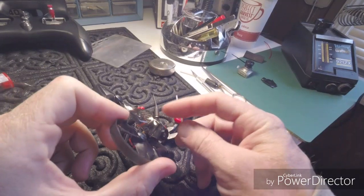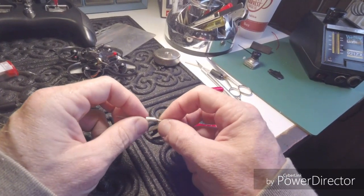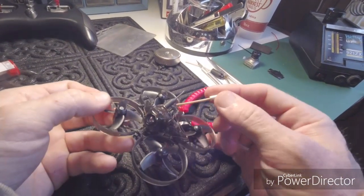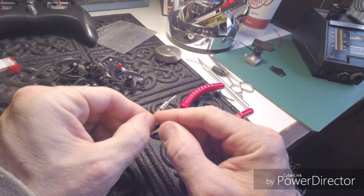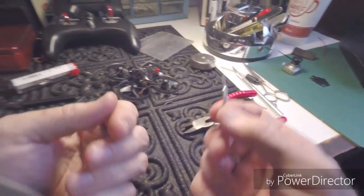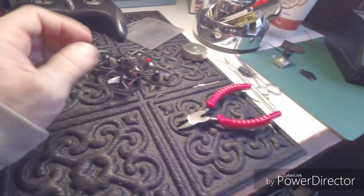That's why I wanted to adapt and do that to the Mobula 7. After I got this on here, I just took some shrink tape and put it over it just to make it tough. But there it is. You don't have to undo the coax from down in here off of the board or anything. All you're required to do is just barely cut off a little bit of the jacket, slide this over it, and you're done — and you get a way better radiated pattern. There you go, Hillbilly FPV. Hope I covered it a little bit better, and for anybody else out there, I hope these mods helped.